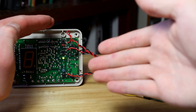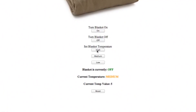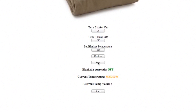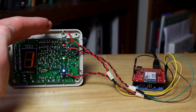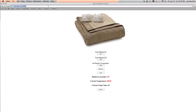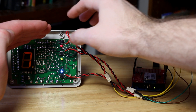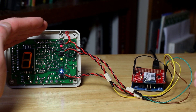We're going to click on the on button and you will see the display light up. The temperature is set to start at 5 by default, and now let's click the high button. Once the web page loads we will see the device go up to high. We'll then try to go low and again it takes a little while to propagate through the internet, but once you have it — boom — it jumps down to low. I still have manual controls over here allowing me to change the temperature. If I leave it at 7 and reload the web page, you'll notice the current temperature value is indeed 7. In order to accomplish that I needed to not only control these buttons but also read when they were pressed manually, so the current state of the device can be stored in the Arduino and accessed via the web page.